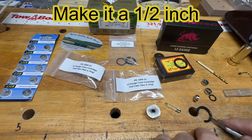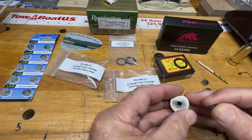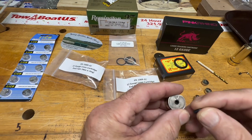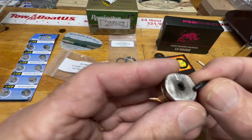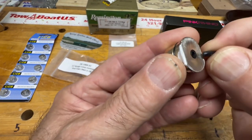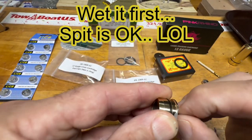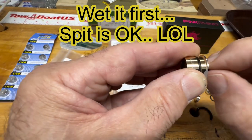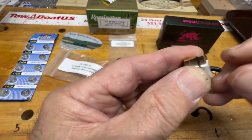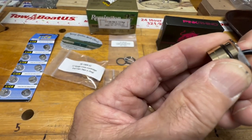You don't need to take the end cap apart unless you're curious like me. Once you have your hole and your o-ring piece, you're going to jam the o-ring in there until it comes to a dead stop, twisting it as you push it in. We're using that one-eighth inch drill bit with a one-eighth inch o-ring — it should be a nice snug fit.